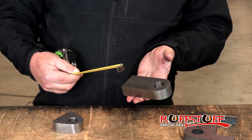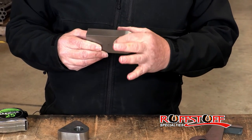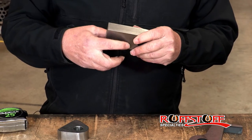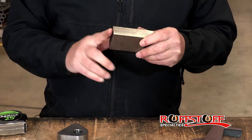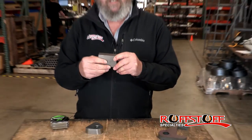The reason for this is so you can weld it inside and out. You're going to weld the outside, and then you want to weld the inside. And if you can, you can even drill a hole in it here or here and bolt it to your frame as your mount. It's a good way to do it.